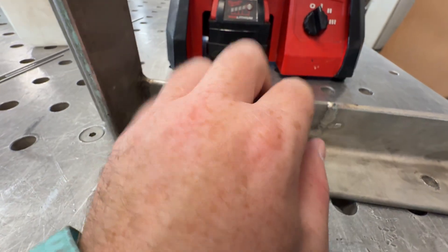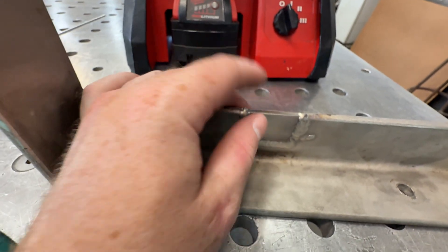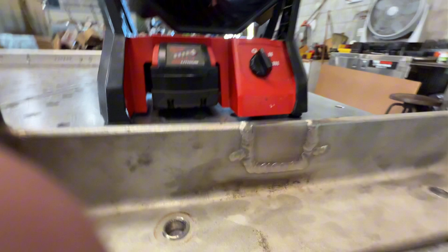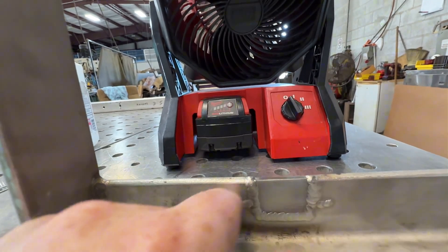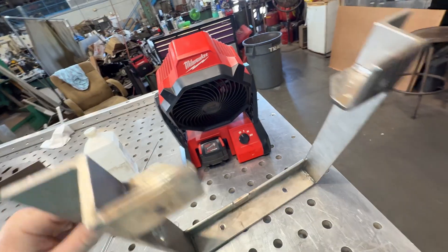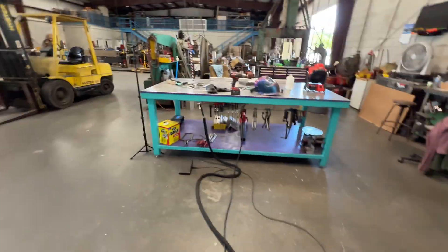One thing I noticed: I didn't put my rounded edge of the flat bar up like how this is. I don't think I had a rounded edge on that plate anyway, but if you wanted it to be super perfect you might have to put a weld on here and grind it down perfectly because it might be just a hair under. Be careful grinding those tacks down — you'll put a little divot in there. For what this is it's going to be perfectly fine.